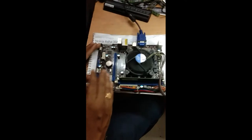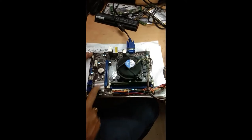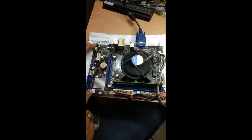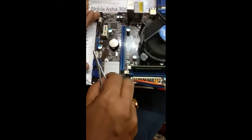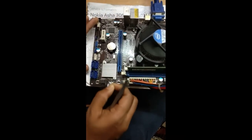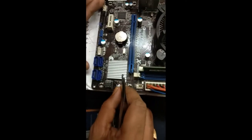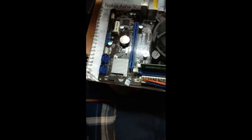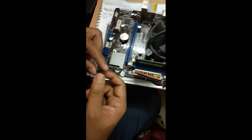For this particular motherboard, the Digilite DL-H61M-VZ4, when this is the case you need to reprogram the BIOS. I checked all sections — every section is okay — but it keeps restarting. So you need to reprogram the BIOS IC. I'm stopping it. This is the BIOS IC and I have removed it from the board — I'm going to reprogram it.